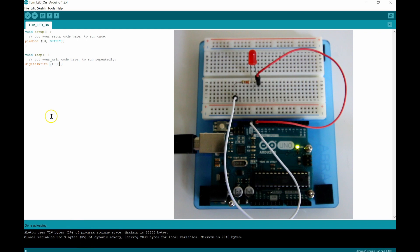We now know we can put this guy HIGH and LOW. So let's change this back to HIGH for 5 volts, and then below we'll do a digitalWrite — note that the W is uppercase, and once you finish it off it turns orange. I've already said above in my pinMode that pin 13 is going to be an output. Now we're going to make that pin go LOW — uppercase — and you'll see that turns blue. At the end of all our instructions we need to put a semicolon.